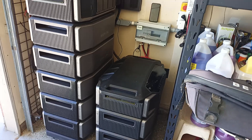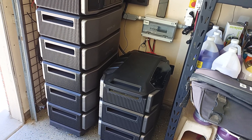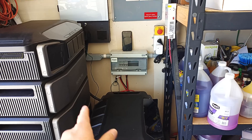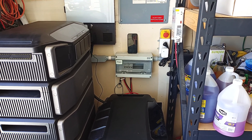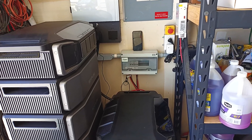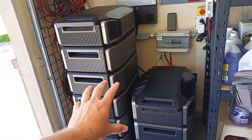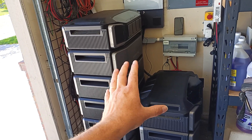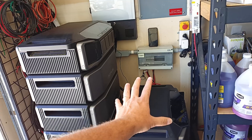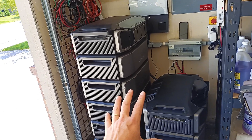On charging speed and capacity — I'm at about 42 kilowatt-hours with seven batteries. Run everything as high voltage as you can and buy it as you need it. I did all the MC4 connections with standard solar-sized wire all the way through the entire system, just so that I don't over-amp the wires. Specifically with these units, you can put higher amperage to them and they'll regulate themselves — but do not over-voltage these. You'll get the magic smoke. Don't even come close to the maximum voltage; it's not worth it. You can run a little high on the amps as long as your wire and safety gear can take it, but absolutely do not over-voltage — I would suggest not even getting close to the maximum, because you will potentially seriously damage these.